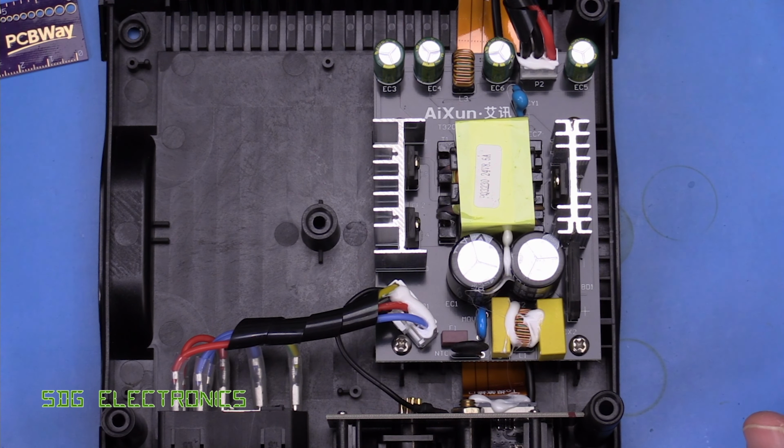So if you are going to be soldering onto some PCBs, make sure they're fully disconnected from the mains or any other power supplies. Looking at the rest of the unit, we've got some really nice construction going on. All of the mains wires are really nicely crimped. The connector here with the mains leads is also silicone, so these wires have no chance of accidentally coming loose.